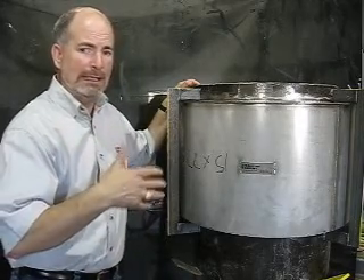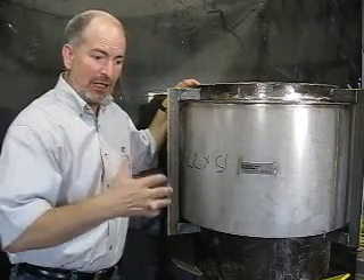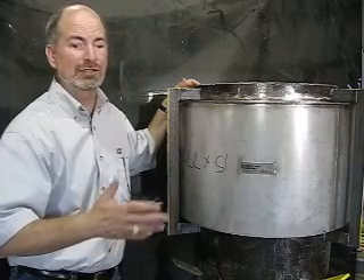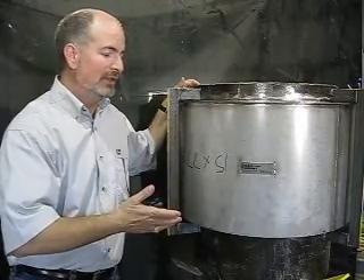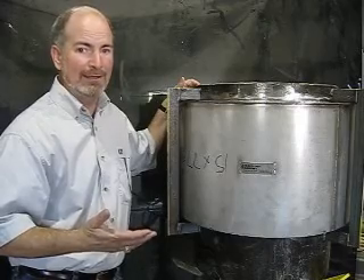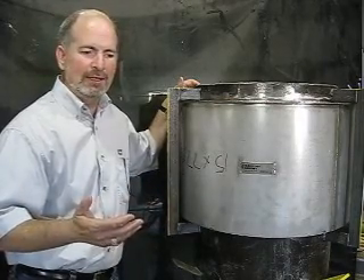So that's going into the LP turbine — it's a dark place, but that's what you can do. If you've never replaced these things in twenty-five years or longer, it's time to replace them. You'll have cracks. You'll be losing BTUs due to lack of turbine efficiency if you've got leaks. And if you've got an outage and you're pulling the hood, it's probably going to be a while before you get that hood pulled again, and these things are twenty-five years old — it's time to replace them. They've had a good run.